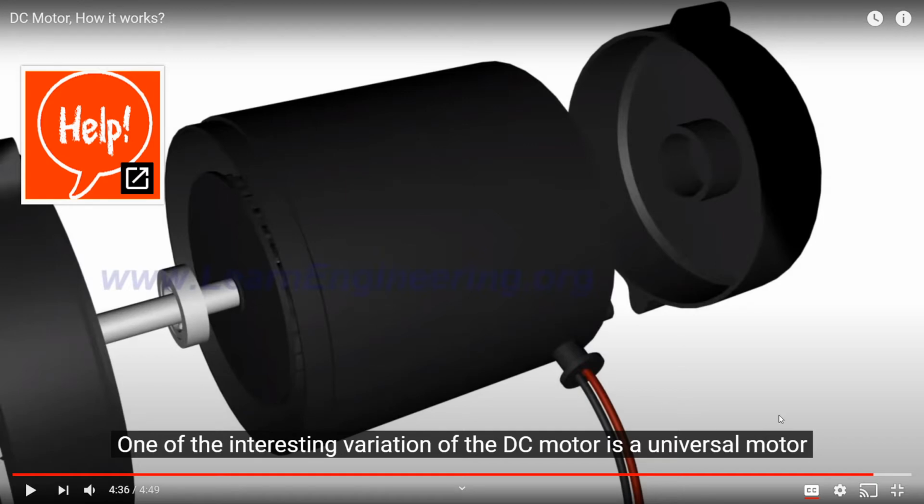All right, I'm going to let him keep going. But we will talk about back EMF. We're also going to talk about induction. The idea is that you don't get anything for free in this universe, so when the loop rotates inside of a magnetic field, it turns out that actually causes electric current opposite to the direction that you want. And it's just how things work.